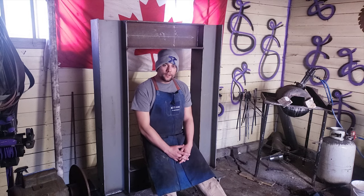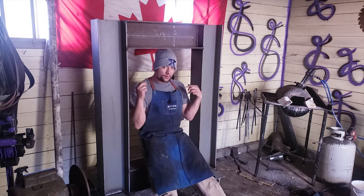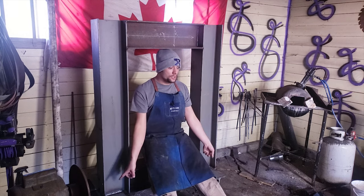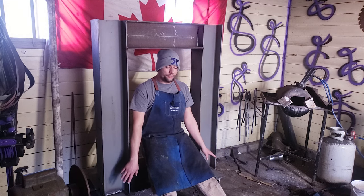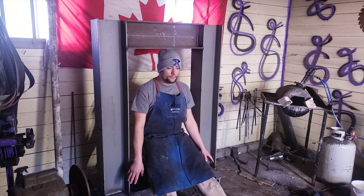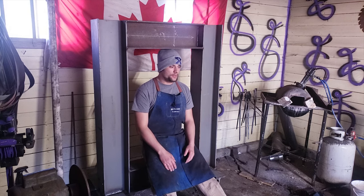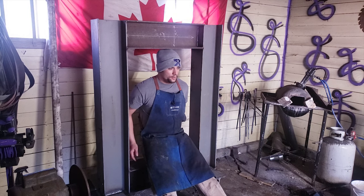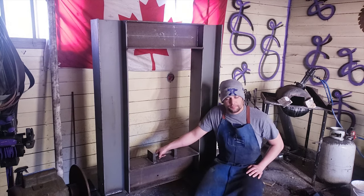So 2 days of welding, thanks to Adrian for helping me out. It's three passes on all four corners. Rest of singles. Down bottom for the legs or the feet or whatever you would call them, the support. Double passes with the welder. And where I'm sitting right here, probably four or six passes or something.